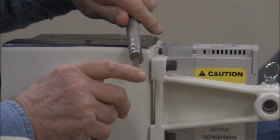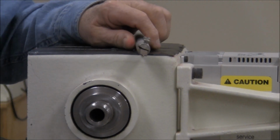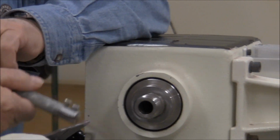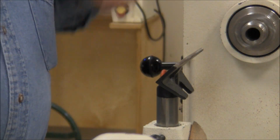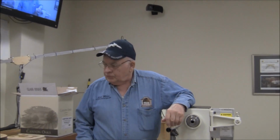but you can change different amounts of pressure on it. You can bend a little hook on it. You can sharpen it, and it works on end grain, not side grain. So you don't want to put it on the tool rest like this. And those are easy to make, and you can make them any diameter you want. I did make one with one of these swimming pool noodles, but that foam does not hold up. It came apart.